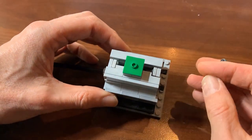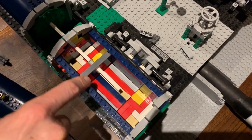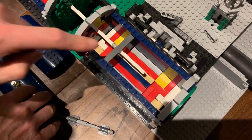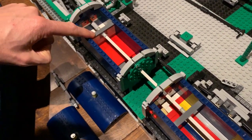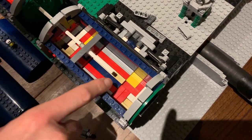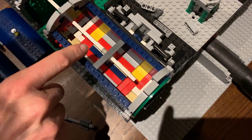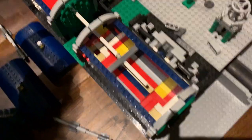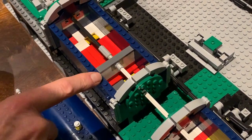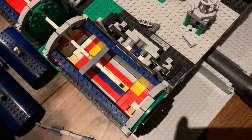Now to the valve chamber itself. You've got the piston here, which is also connected by one long axle to the piston in the other cylinder. Each cylinder has got four valves — two inlets and two exhausts. The inlets and exhausts in this one are actually connected together, as per the original Trencherfield Mill engine. I'll now just disassemble one cylinder so you can see what's underneath.